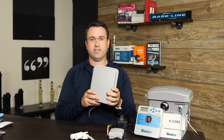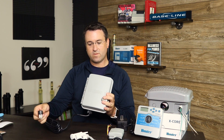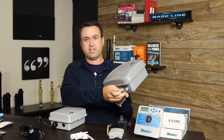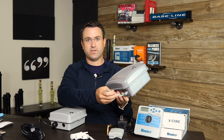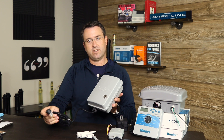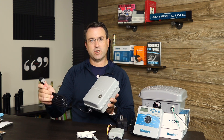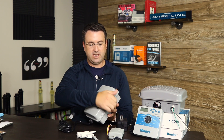The next thing you'll notice is that it has a plug that can go directly into the wall. On this Irritrol model, it doesn't actually have a plug — it just has wires coming off the bottom that you can either wire onto a pigtail to plug into the wall, or hardwire it directly to your electrical source. The reason you can plug it directly into the wall is that the transformer is built into the controller. Both of these models have a 24-volt transformer, so we have 110 or 120 power coming in, and the power going out to the valves is only 24 volts.